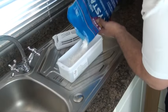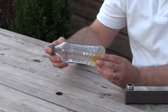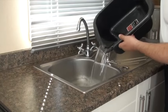In the DVD that accompanies Flow I'll show you what way to leave your water system during the winter season and every other winterizing technique you could ever want to know. I'll also show you how to drain washing machines and dishwashers and how to cleanse the inside of your boiler without even opening the boiler cupboard door — which should save you about 15% on your gas bill. Once you make a little checklist on a post-it note you can completely winterize your entire property in about 15 minutes. For this property there was about four and three quarter litres of water; in modern caravans you should get anywhere from four to five litres depending on the water system layout.